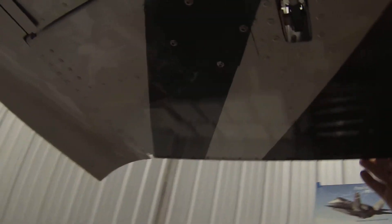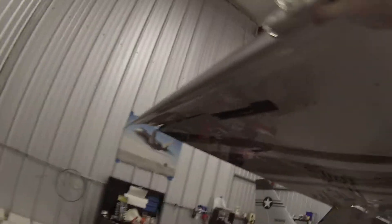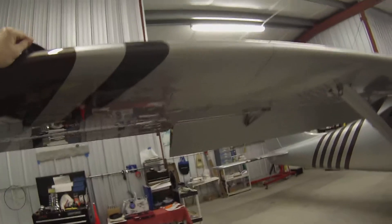Come down to the other hinge — I can see the safety wire inside there that holds the bolt, so make sure that's good. Check the counterweight for security, nothing in the vent for the fuel tank, check the lights — the position lights, the nav lights. Check the fasteners on the wing tip, make sure the vortex generator on top of the wing is secure, the hold-down strap is good, and generally check the condition of the wing looking for wrinkles. Check the inside vortex generator as well.